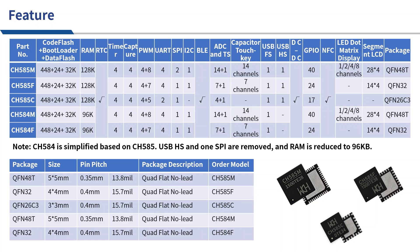These are all the models of the CH585 series. There are five chips to choose from according to different needs. CH584 is the simplified version of CH585 — high-speed USB and one SPI are removed, and the RAM is reduced to 96 KB. If you don't need high-speed USB, the CH584 series will be more cost-effective. As can be seen from the table, the package size of CH585C is only 3mm by 3mm — quite small.